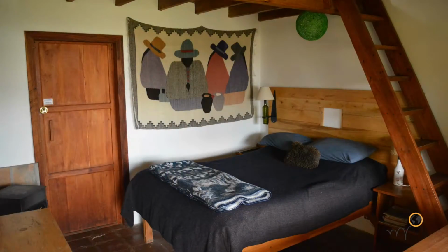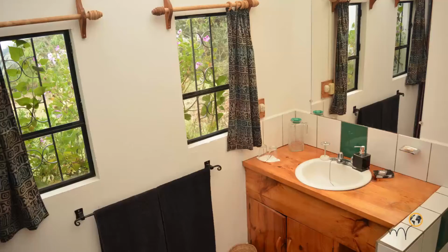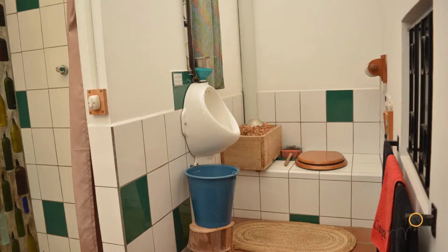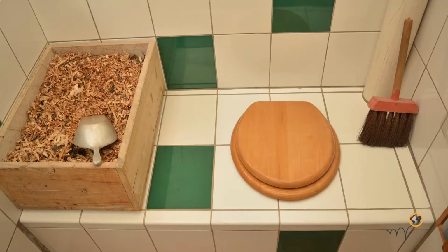For private rooms, because we started the Black Sheep Inn with sort of communal bathrooms, and then when we wanted to make it a little bit nicer for the guests, we added private bathrooms. So we have composting toilets in the private bathrooms that are based on a barrel. It means that the construction's a little bit smaller, and it's our job, when anybody checks out, to take the barrel and empty it into one of the larger composting toilets. Or if somebody stays for 2 or 3 days, or there's 6 people in the room or something like that, you might empty it sooner than that. But in general, they don't fill up that fast. So it's a little bit of a transfer station that's more work for us, but we're staying with our standard of having a composting toilet in every room.